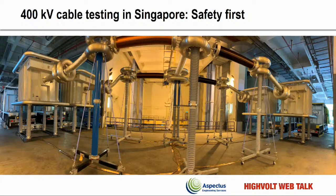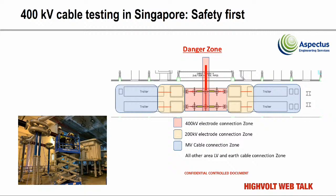Insulation supports as well as insulated suspension ropes are also used to support the aluminum duct assembly. The most important thing is safety, because you have a very large test area and need sufficient clearance. We secure the testing area with notices, barriers, locks, guarded entry points, staircases, and driveways. The best arrangement is when we have permission to lock down the entire substation during the test. We deployed eight test systems to achieve 391 kV and 300 amps of testing power to test extra high voltage cables with a length of 23 kilometers.